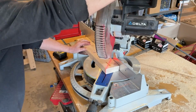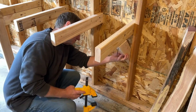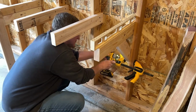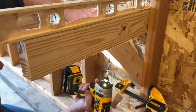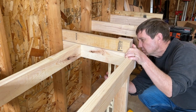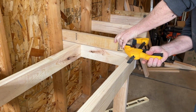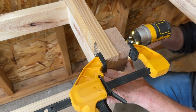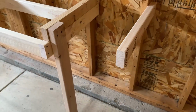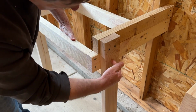I'd like to make use of the space underneath the bench for storage, and I think it's just a whole lot more flexible use of space not to have a bunch of legs. So I'm using these angled supports that'll be more than strong enough. Oh, I did use 2 legs, which will help me get the proper height of the saw shelf relative to the wings. I'll expand on that a bit in just a minute. But for now, I'm only attaching the legs to the side wing shelves and not to the shelf that the saw will sit on.